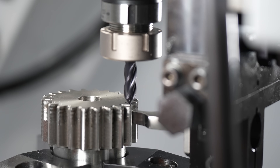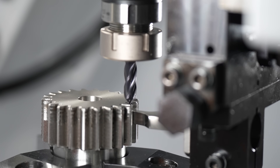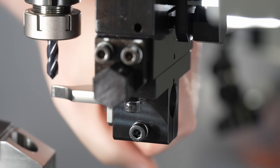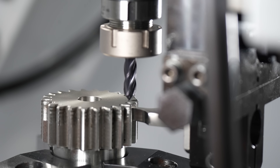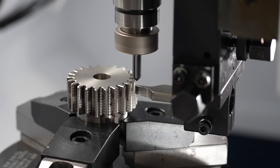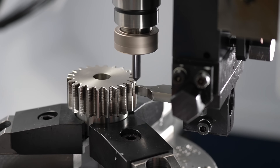There's actually one more thing. Let's say you do all these steps and your chamfer comes out uneven on your gear, either left to right or back and forth. If you look right here, you can crack these two screws loose. There are two adjustment screws on the side and the back of the block that holds the stylus. You can use these to make your chamfer completely even around your gear. Most likely the first time you set this up, you will have to make these adjustments, so just know that these are there for whenever you need them.